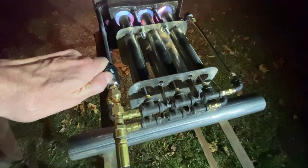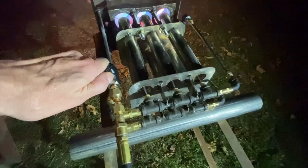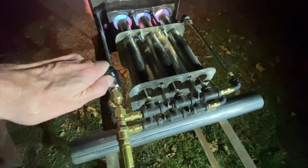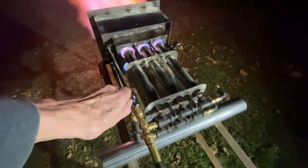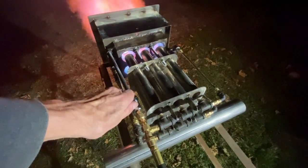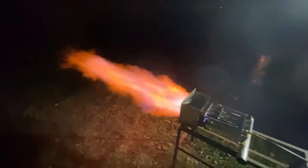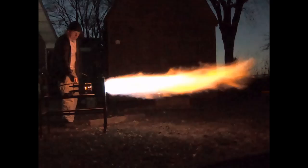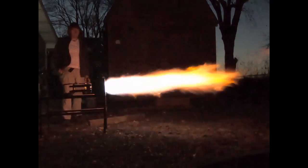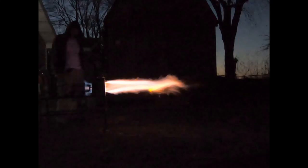Had that thing been glowing red hot like that brick is, I'd be a lot more worried because that would cut down the lifespan. If you're yellow hot you get about 400 hours out of 16-gauge stainless and 800 hours out of one-eighth inch. If you're red hot it'll run forever — just keep going and going. Yellow hot, you will eventually burn a pinhole. Man, look at the power of this thing — it's almost completely stiff, barely lifting up into the air at all.